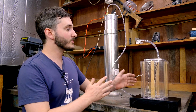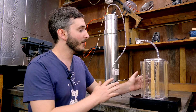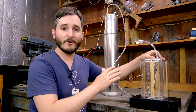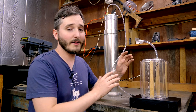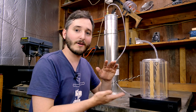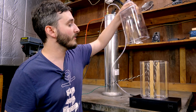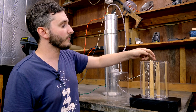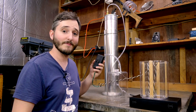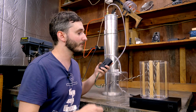The way I'll do that is with this, which is basically like the gasometer that I built in my previous video, but I've made this one out of clear plastic. We'll be filling this with water and using it as a gasometer to inject incremental amounts of gas into the containers and then try to ignite it. We'll start with a little bit of wood gas, then inject a little bit of atmospheric air — a little more and a little more — until we reach a flammable mixture. The way I will attempt to ignite these mixtures is with a pair of electrodes in the middle of the tank, which are connected on the other end to a stun gun. So when I've injected various amounts of gas, I'll be able to see if it ignites with this electric arc.